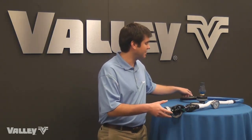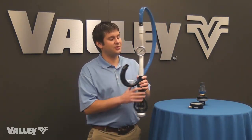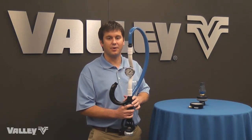The most appropriate place to check your pressure on a center pivot is actually at the end of the machine. It's not always the most convenient, but if you constantly monitor it every few days or every few weeks during the growing season, depending on how your well has performed, we can ensure proper pressure is delivered to the end of the machine, which ensures that the rest of the machine and all the sprinklers have proper pressure.